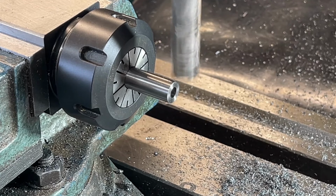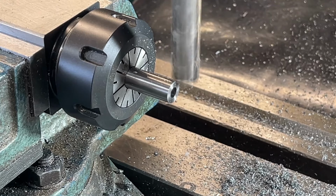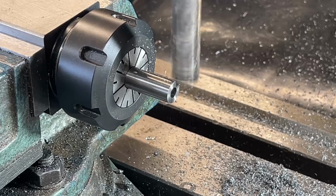The cutter is positioned so that it machines material away to leave a tooth behind. The cutter is positioned 20 thou from the edge of the tool and another 20 thou from the centre line to the edge of the cutter. This will give a cutting tooth of around about 3/32 wide.